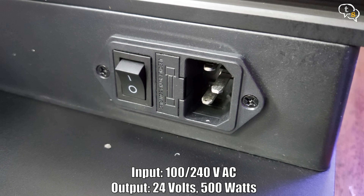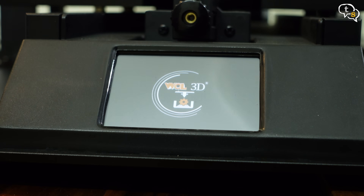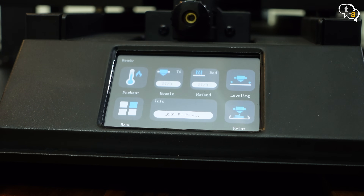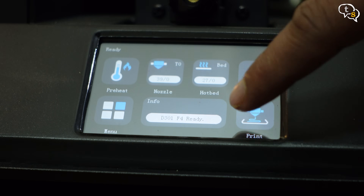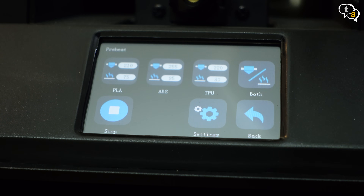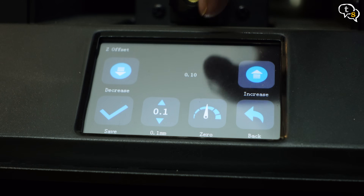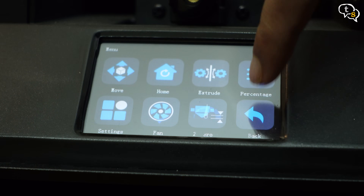Here's the power port and switch. Plug in the cable provided and turn the printer on. Once the printer turns on, we have the VAL3D logo on screen. This is the touch screen and it starts up quite fast. The touch screen allows us to interact with the printer — it allows us to level the bed, start a print, and also set up defaults such as nozzle and bed temperatures. We can also set the Z offset if the printer is not keeping the appropriate height between the bed and the nozzle.